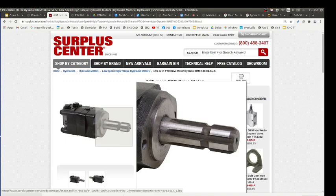There's a safety issue here. You have this shaft that connects the back of a tractor to the implement, and that's where farmers get killed, getting wrapped up in those shafts. When I design implements, I would rather have the motor right on the implement, so you just have hydraulic hoses and eliminate the danger of somebody getting wrapped up. Hydraulics lend themselves to that because you can put the motor right on the device.